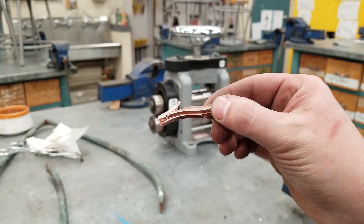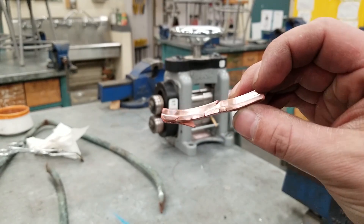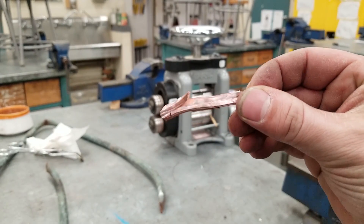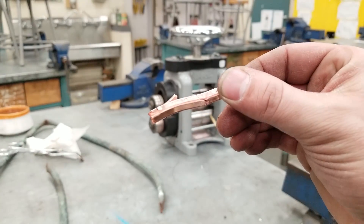So there's an issue. I started forcing it instead of slowing down and annealing it again, and you can see it's cracked and broken in some places. So I'm going to have to melt down the ingot and do it again. I'll fast forward to when that happened — shazam — and another new ingot. Okay, off to the rolling mill.